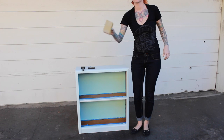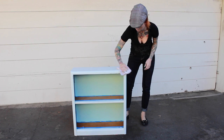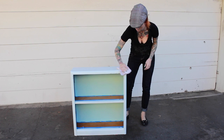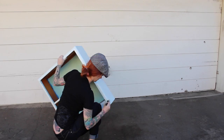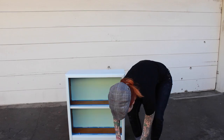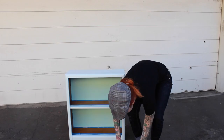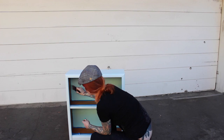Make sure the shelf is dry, and then go back over it with that same 150 grit sandpaper just like you did with the primer. You want to do this in between each coat of paint just to make sure you don't have any gobs of paint and that the finish is really smooth. Again, go over it with the towel to make sure all the dust is gone, and then just go back and repaint. If you sand too hard on any edges you're going to take the paint right off, so be really careful — give the flat surfaces a harder sanding than the edges or corners. Once you have the first couple of coats on, do less cutting in and more rolling, because paint brushes tend to deposit more paint than a roller.